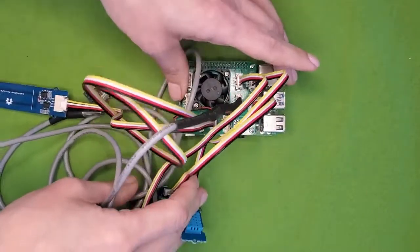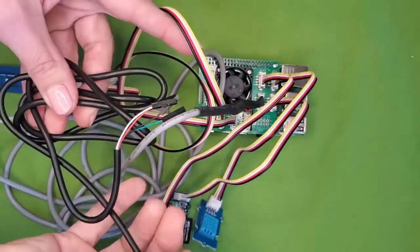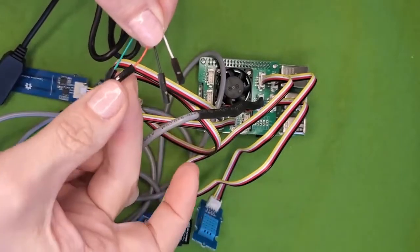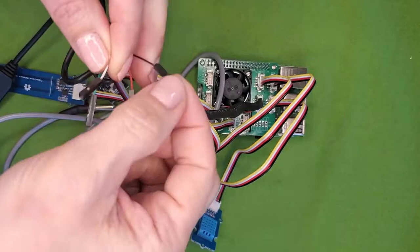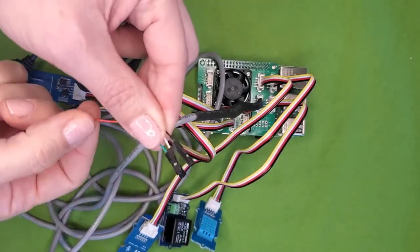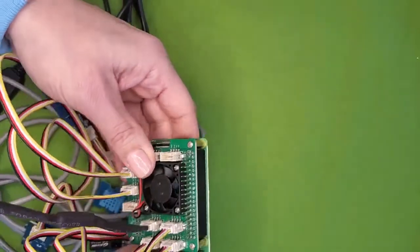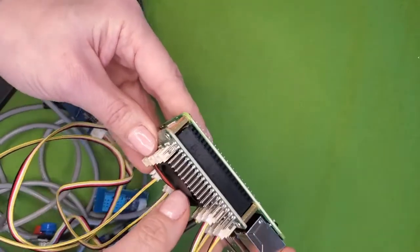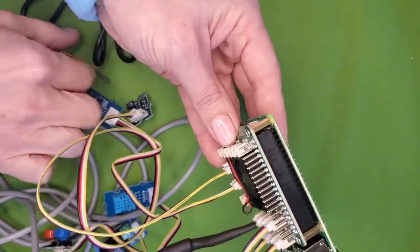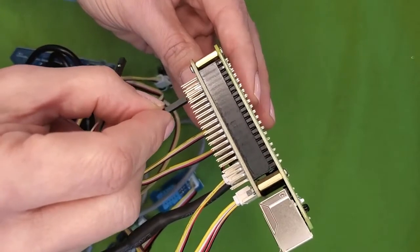That's all our sensors. You can see we have a bunch of wires now, so you'll want to find a way to keep things under control. The next step is to attach the USB TTL serial cable to the pins on the Raspberry Pi. The cable has four wires: white, black, red, and green. We'll be connecting black, white, and green, and leaving red unconnected. We're connecting the pins to the outside edge — be very careful to leave a space of two pins at the end of the row, and then connect black, white, and green in that order. Your connector should slide right onto the pin. Make sure to leave those two spaces at the end.